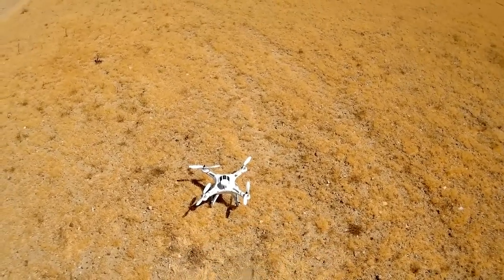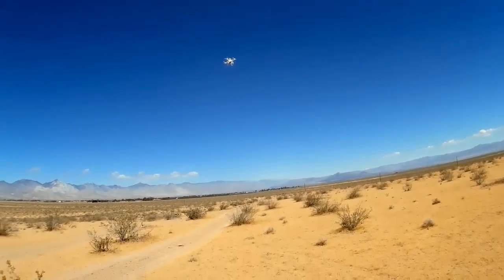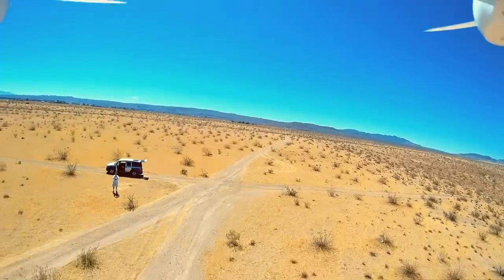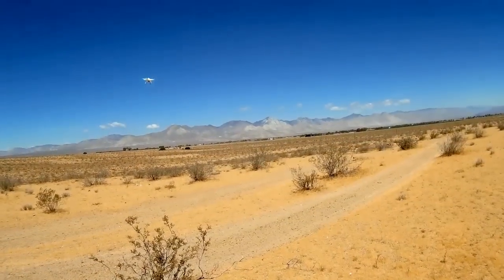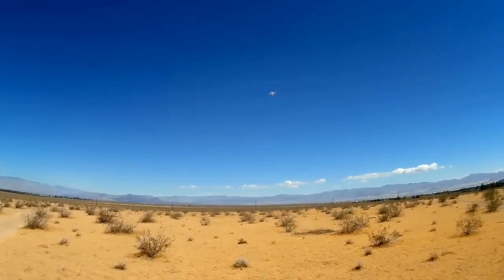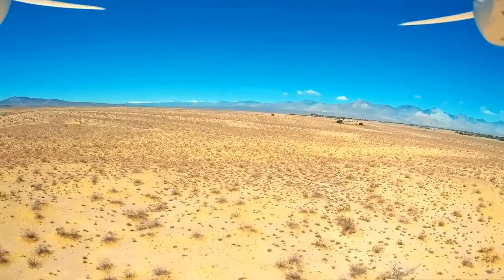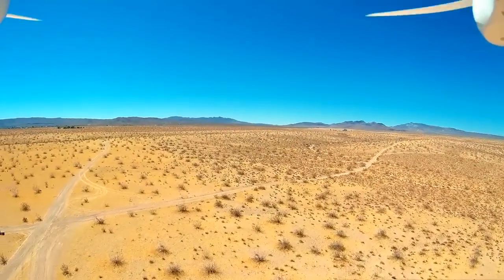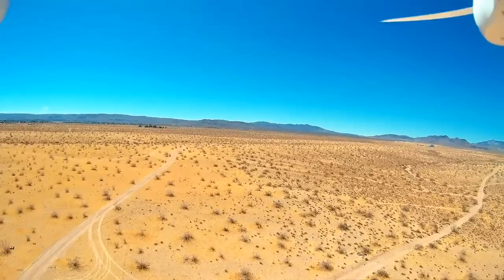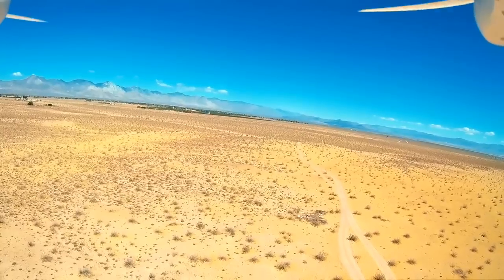We're starting off in manual mode and sending it up skyward. This is in manual mode — flying it just like a toy quadcopter. Now the first thing I want to show is not headless mode but altitude hold. We set switch one to one and switch two to two, and it remembers this altitude. In effect, it's using the GPS to maintain that altitude. I don't have to control the altitude at all.